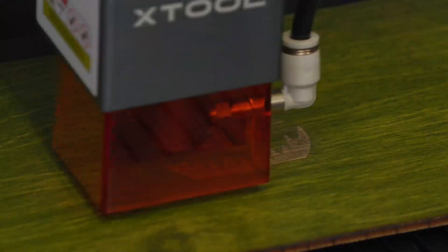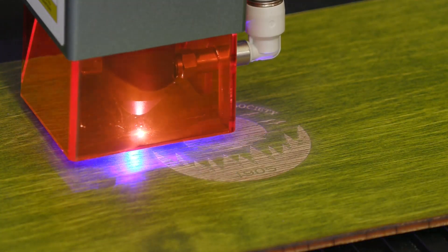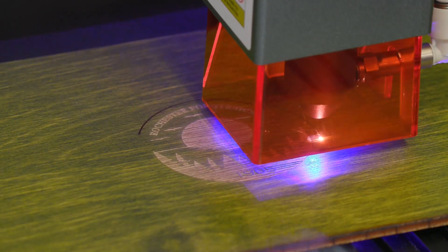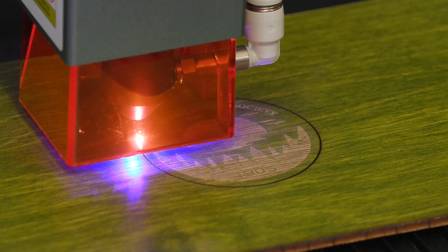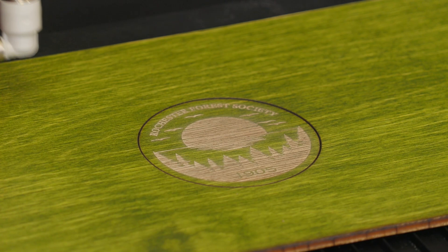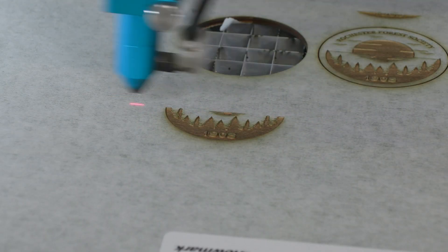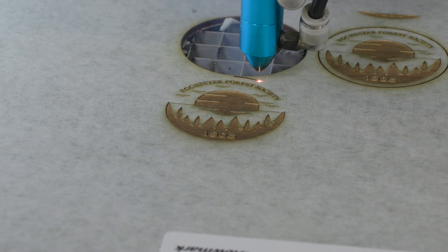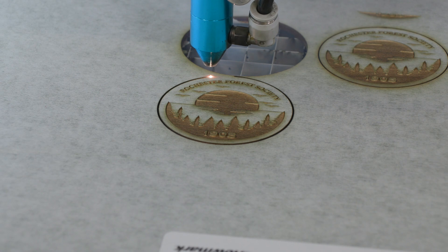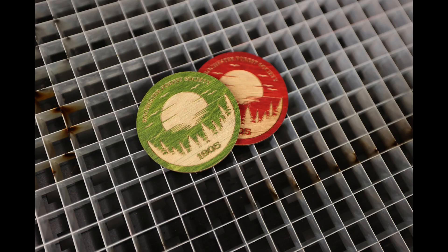While we didn't really end up marking this material too much, we did want to make sure we at least tested out the marking before moving on to what we think this material's strong suit is, which is cutting out pieces for mounted signage and displays. The CO2 gantry is up next, and this is on the Ranger 3 from Light Object. Really clean cuts. The dot size is a little bit large, so you struggle with some of the smaller details, but the final result is high contrast and pretty high quality.